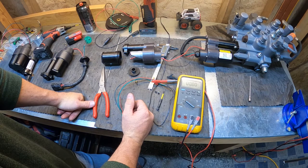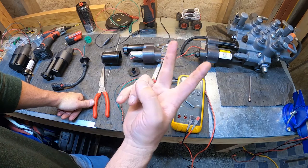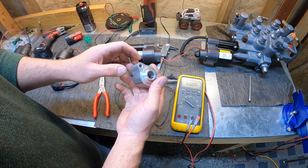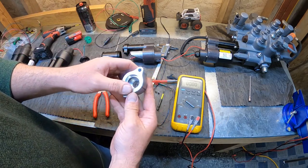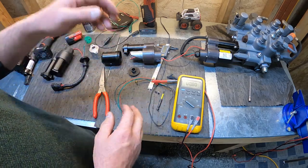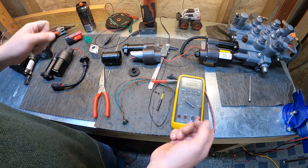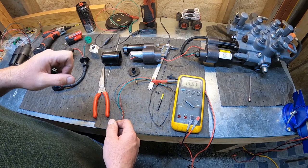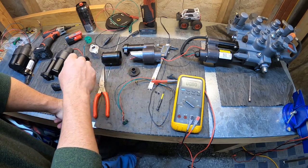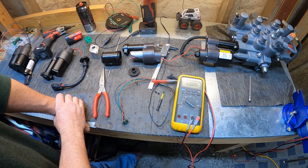What else? I think we've talked about how to calibrate generation one, generation two. Talked about flip actuators, part numbers. There's only two part numbers from Bobcat. We talked about our new adapter, if we have to upgrade. We talked about machine calibrations. Either Bobcat, the dealership, can do it for you with the computer. Some machines you can calibrate using the joysticks. There should be an operator or service manual for the machine. But even if you fix your original actuator and put it back in, make sure you run that calibrator or the actuator calibration.